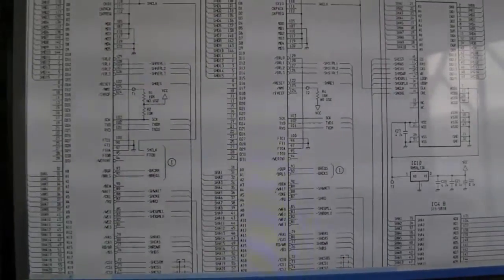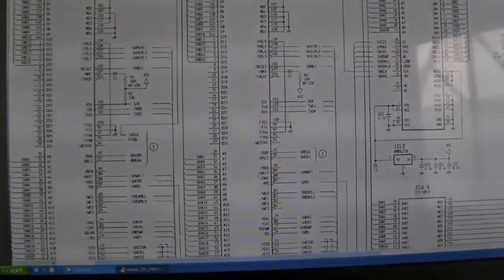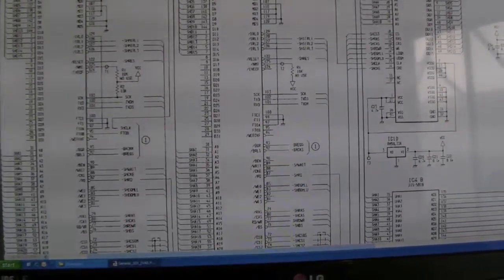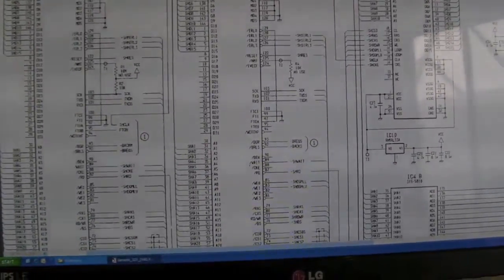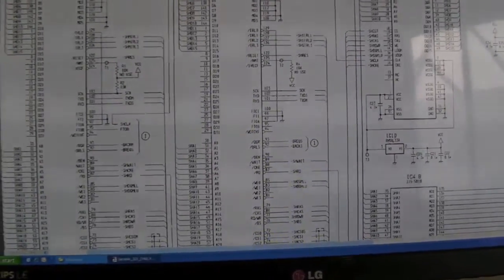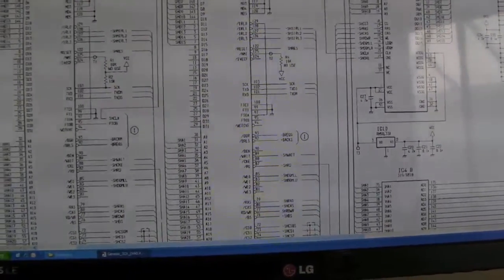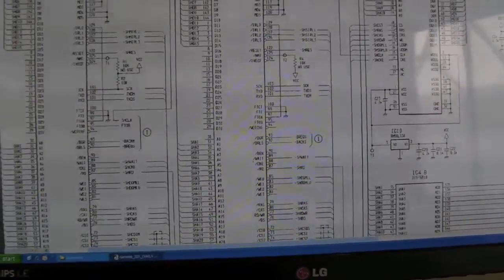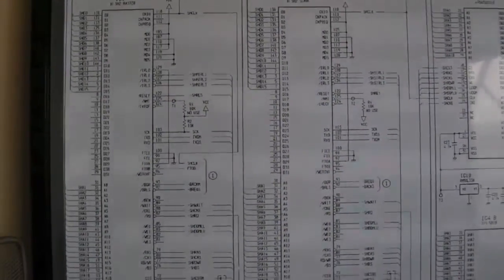This could cause problems in future if those ROM images become corrupt - you'd be a bit stuck really. Not really sure how you would reprogram one of these. If the ROM became corrupted, you may have to take the chip off and use some sort of programming solution to reprogram it, provided the CPU is still working and whatever interface it uses to program that ROM is functional. You'd have to research more on how to reprogram the embedded firmware on these SH2s.